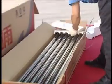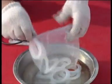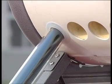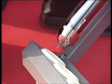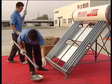Open the vacuum tube package. Take a small basin of water. Open the anti-dust circle package and put the anti-dust circles into the water. Take a piece of tube and circle the anti-dust circle 10mm from the open end of the tube. Dip the open end of the tube into the water for lubrication, then fit the open end into the hole under the tank. Reel and insert the tube into the tank hole slightly. Hold the close end of the tube into the tube dock and press the anti-dust circle to seal the hole of the tank. Fit all the tubes into the holes.